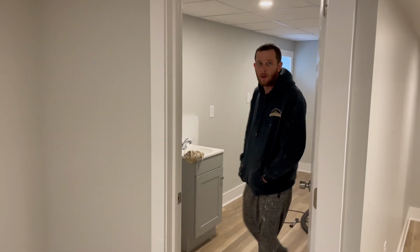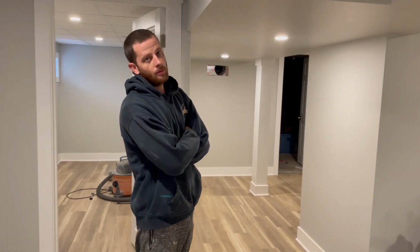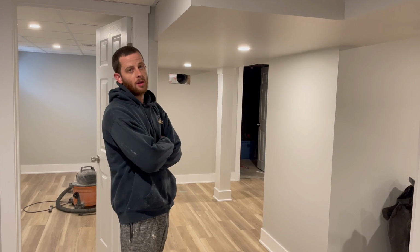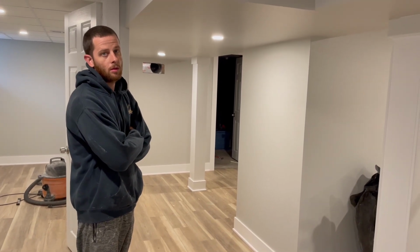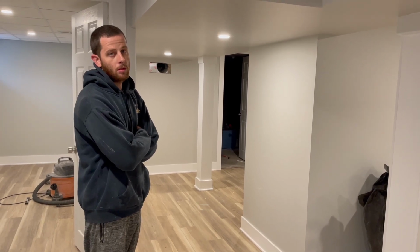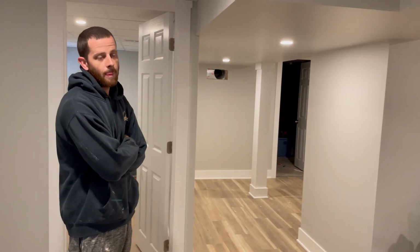As far as flooring in the house flipping or renovation process, you want to do it as close to last as possible. We're almost done. We've got touch-ups, a couple outlets, appliances. We can't do the quarter round until the floor is down, but you do all the trim and painting before the floor goes down. Then the floor, and at this point it's just faucets, mirrors hanging in the bathroom, closet racks, all kinds of odds and ends, but touch-up paint.